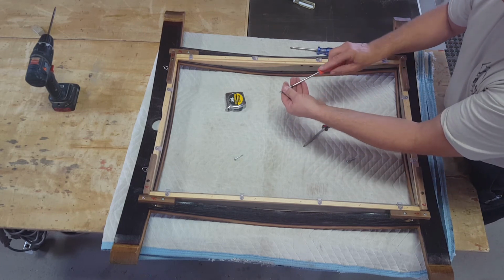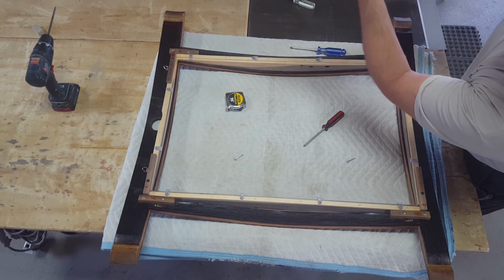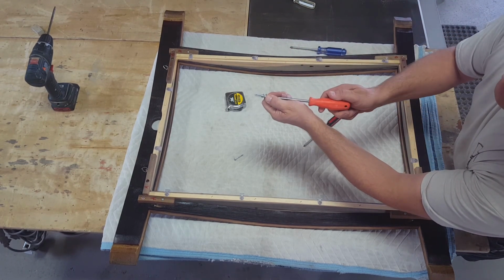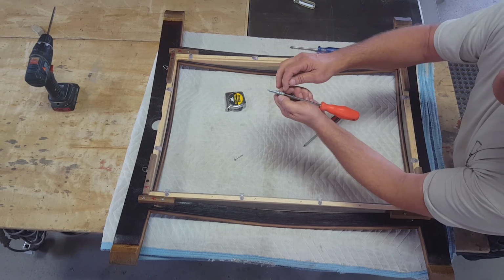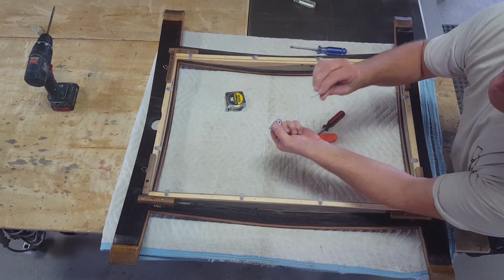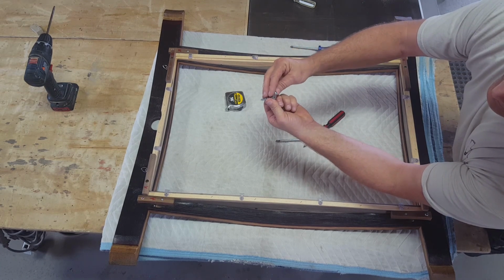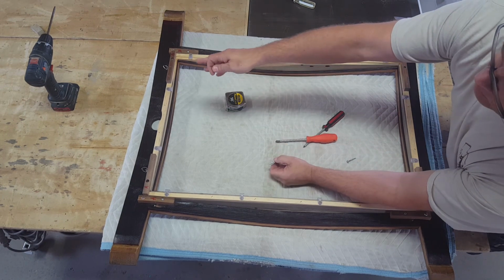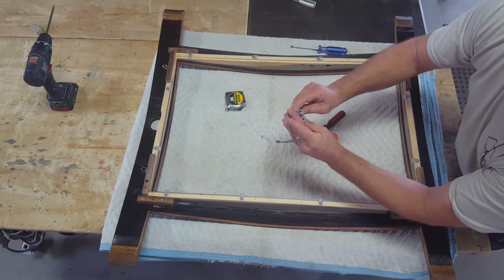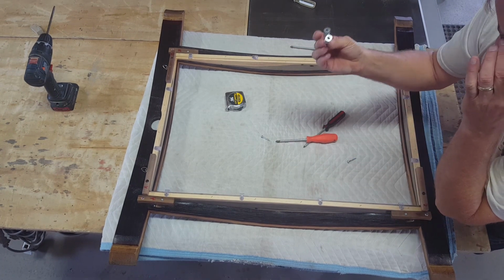You take a Phillips head screwdriver like that and poke it into your sheetrock, and then with constant pressure you can screw this into the wall and tighten that up until this part is flush with the wall. Then another screw goes into this hole here and you screw it in till it's like that much sticking out, and you'll be able to hook those right over the head of that. I'll send a couple screws with these. You'll see that. And you can use this or not, whatever way you folks want to do it. But I'll send these anyways.